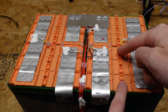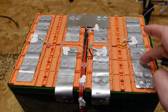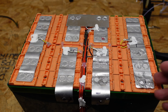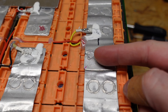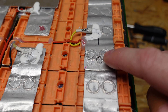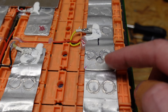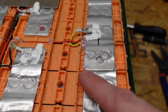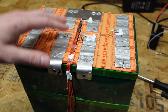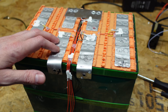The optimal solution would be to remove these three cells and replace them with new ones — there are plenty of 100 amp hour cells on the market that would fit this form factor. The issue is this aluminum is laser welded on and you can't solder to aluminum, so there's no great way to attach new cells. This grouping of three at 0 volts appears connected with two pieces of aluminum, with what looks like a hole drilled in one such that it was intended as the original terminal and then folded over and laser welded. I don't know if this had been previously repaired and resold as new.